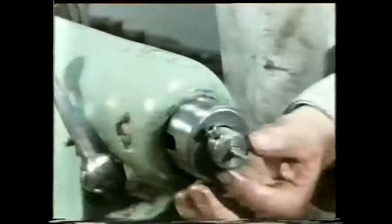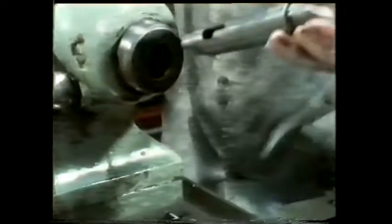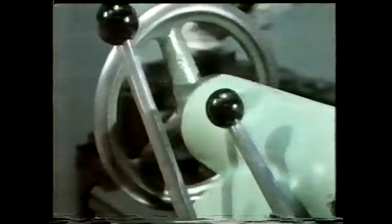Once it's been centre drilled, we can machine the hole using a twist drill — in this case, a large diameter drill. As well as preventing the component from flying off the face plate, the clamping forces must also provide sufficient frictional restraint to prevent the component from moving as a result of the cutting forces.